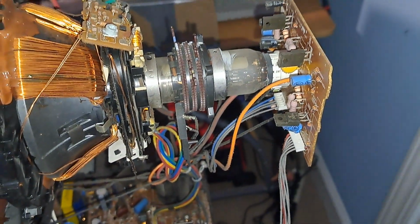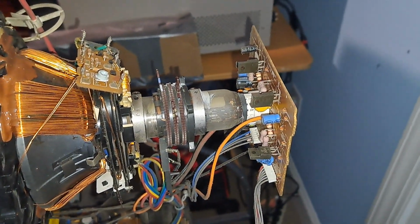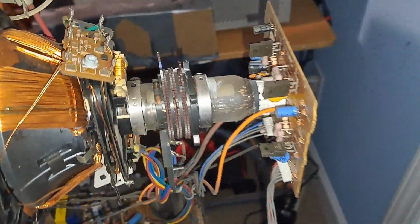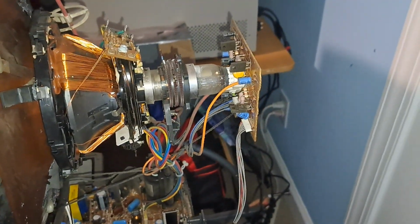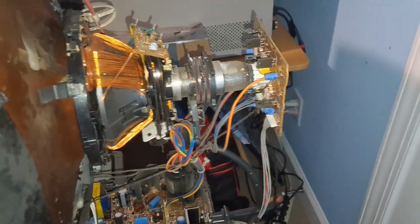If you don't have a tensioner like this, which I hope your TV does, because it makes life so much easier, just be careful whenever you go to put the rings into their correct position and then either adhesive or tension them back on. With tensioning, all you have to worry about is by accident turning some rings while you're tensioning it back tight. So what I usually like to do is put pressure on the rings just by holding them and pressing to the left and then pulling up and rotating it around. Or for rings that don't have a tensioner like this and instead are tensioned by a screw, usually you just want to glue them in and then hope that they stay in place. But yeah, so anyways, let me put this back on the tripod and show you what exactly it's going to look like whenever I do this adjustment.